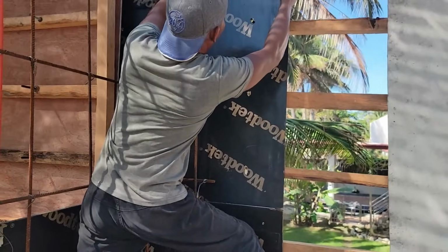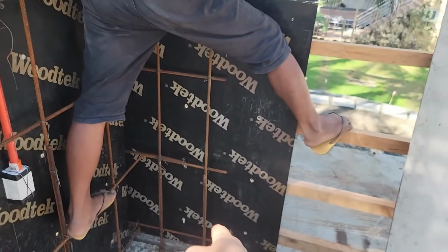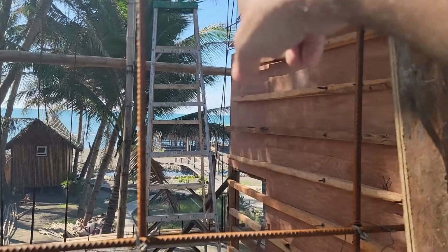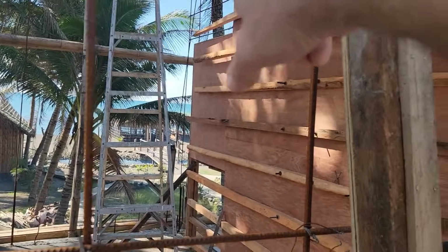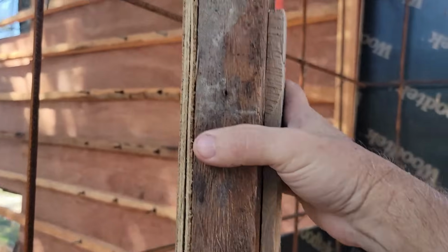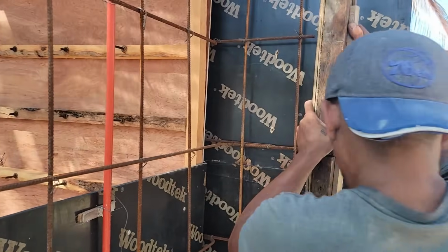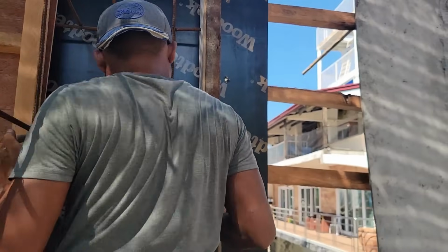So we're going to go ahead and put this on first onto the wall right there where that steel ends. Get it nice and level. He just made a watermark with a water level from the top of that door opening right there where that buck is. He made the same mark here. So now we're going to cut this off. It's probably too long. We're going to cut it off right to that length. He'll make a marker on it. He's going to transcribe right now.